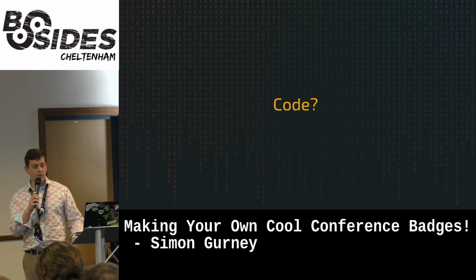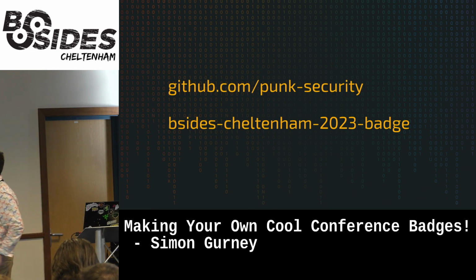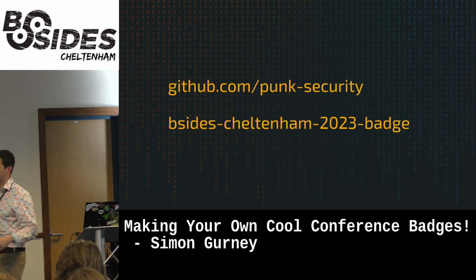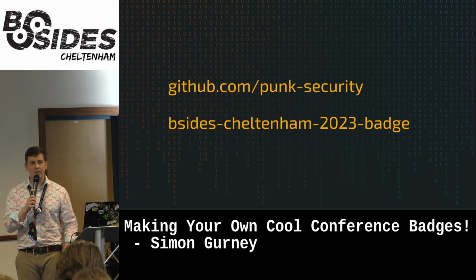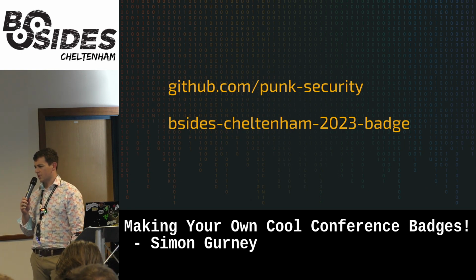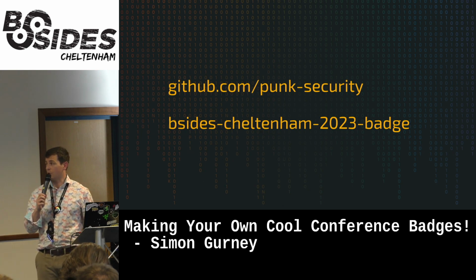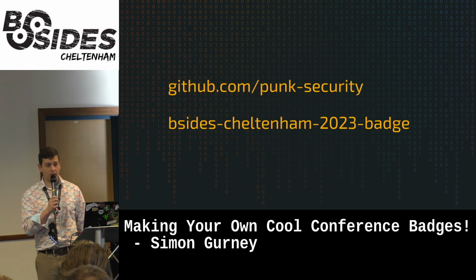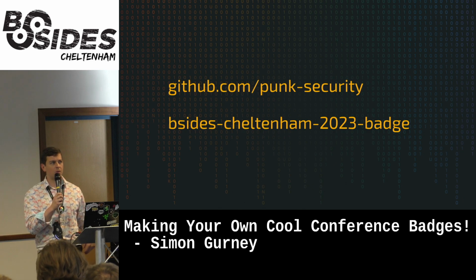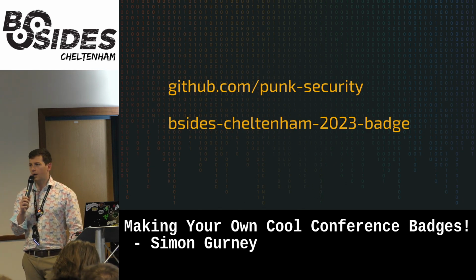And it's Arduino compatible. So you can go to Punk Security's GitHub. There's a repo called BSides Cheltenham 2023 badge. You go on there and there's the Arduino code and a bit of a README for how to get it set up. It's not that hard. You install Arduino, you install this board manager by this crazy guy who maintains an Arduino library for ATtiny chipsets. And then you can predominantly just use Arduino code. A couple of times you have to drop into raw ATtiny code for some of the deep sleep stuff.